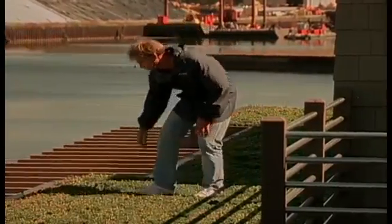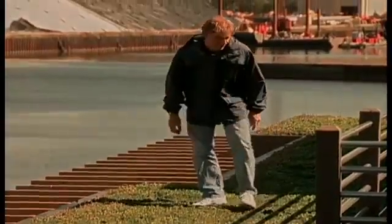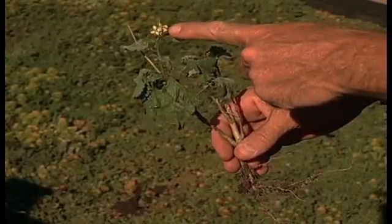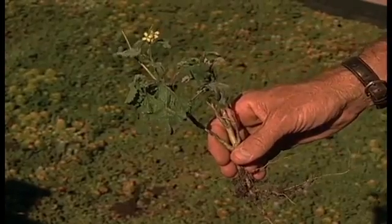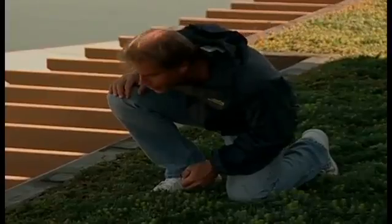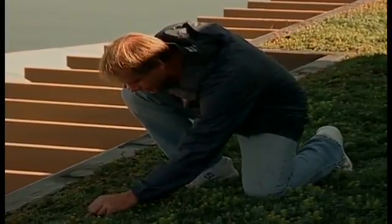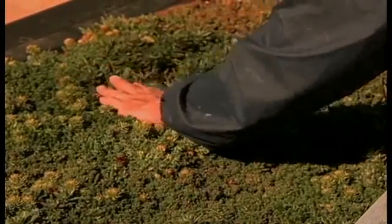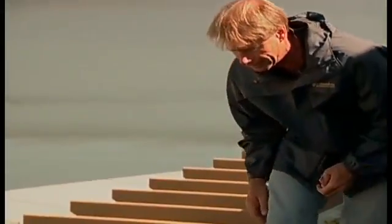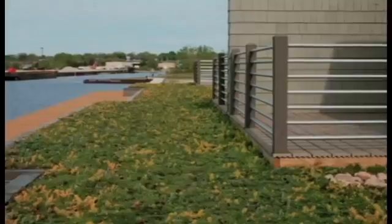Weed control inspection and hand weeding should be conducted every two weeks. Pull any and all weeds, no matter how small, and never allow any weed to flower, set seed, or complete its life cycle. The byproduct of this regimen is that each inspection and weeding event requires minimal time, as weeds are headed off proactively. The regimen should be conducted from spring through fall in areas where the roof becomes frozen and snow-covered in winter. In warmer climates, it should be continued year-round.